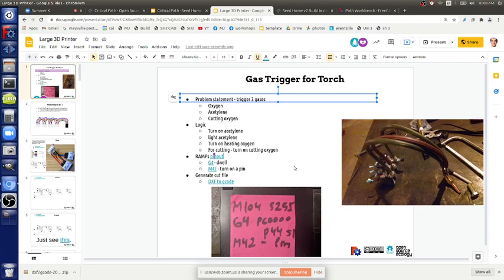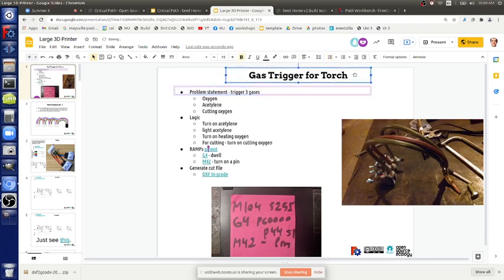But you have to be a little careful about that, because upon snapping back, turning off, there's some back EMF happening. Oh, okay. So that might fry your board. We need a diode through. Or perhaps? Yeah, a diode. So right now we have the blower fan. We would connect that output. I would still go through the solid state relay, because that will block that back EMF. A relay is a spring, a coil that's moved, but when you spring back, you generate electricity. It's a generator. It's a linear motor, but motors are generators too. So you get this back electricity that can fry your board. As you see, there's detail here that you have to pay attention to. Back EMF, back electromotive force, is the back voltage that you get from relays.